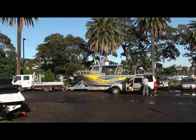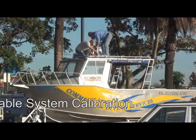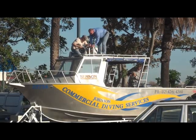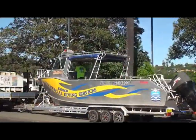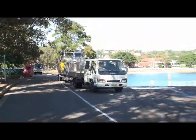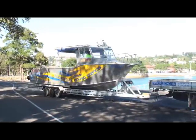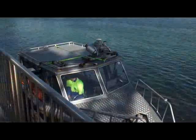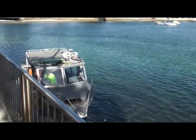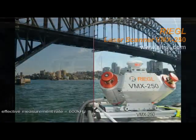We're now going to move the system very quickly and simply straight from the vehicle and put it onto a boat, because we're going to scan the same area from the shore from the boat. This took about one hour to transfer the system. We then initialized the system by being in a static location for five minutes to initialize the GPS. After launching the boat, we initialized the IMU again by running figure-of-eights around the open ocean, similar to the shore-based system.